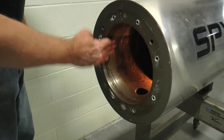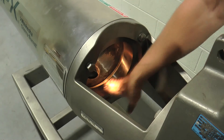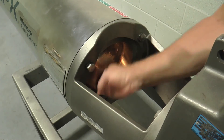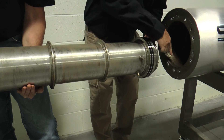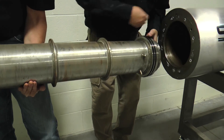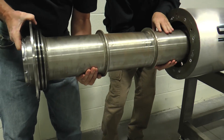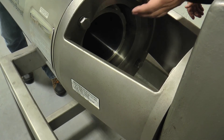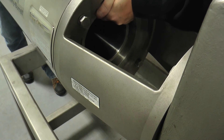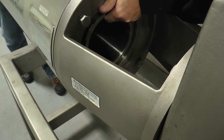Then lubricate the O-ring sealing surfaces inside the jacket. Insert the product tube into the jacket cylinder from the non-drive end. The support pins on the heat tube should be at the 5 o'clock and 7 o'clock positions during installation. Push the product tube into the cylinder slowly with assistance on the drive end to guide the tube into place and avoid cutting the jacket side O-rings.